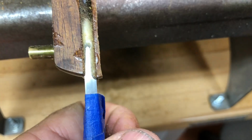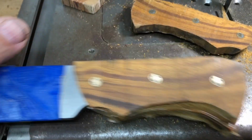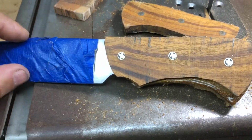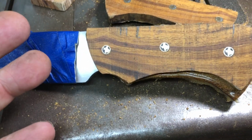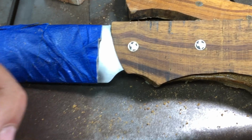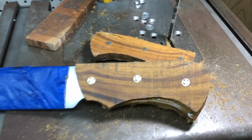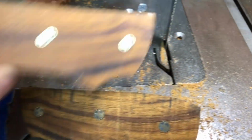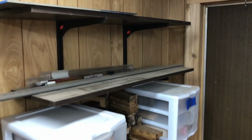It's gone. There's no saving it, and I thought, well, maybe I can at least make a different knife out of this. But I've already hardened this, and I won't be able to cut it unless I anneal it. So maybe I'll just finish cutting this and set it to the side, and when I'm not so disgusted, maybe I'll figure something out to do with it down the road. So, Doug, I'm starting a new one.